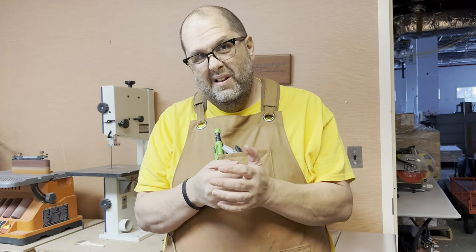Truth of the matter is, the oil doesn't penetrate that far to begin with. That's one of the reasons I stopped doing the thing with the bath, because soaking it forever barely was making anything go inside the board. It looked really good, it felt really good, but there was one board I had that actually broke and I had to cut it apart. And when I did, I realized that the oil didn't penetrate that far to begin with. So since the oil is not penetrating that far anyway, why slow down your processes to try to get it to where you think it's all the way in, and in reality you could have stopped hours before.